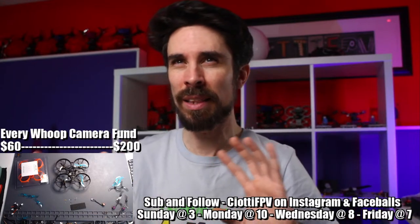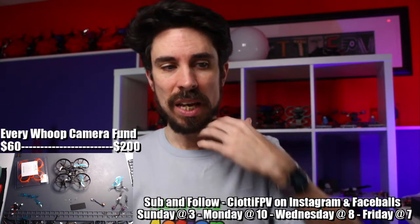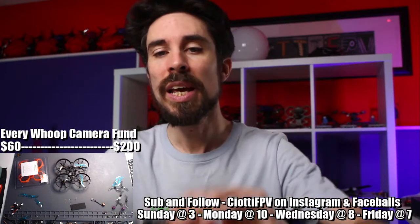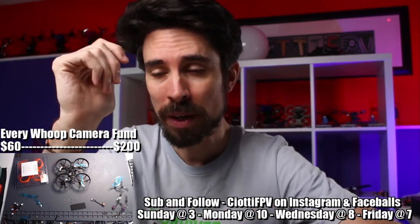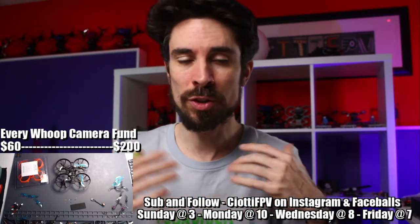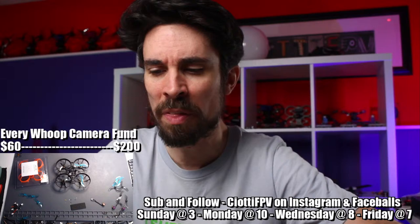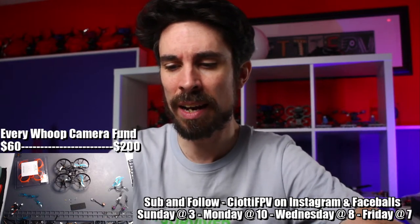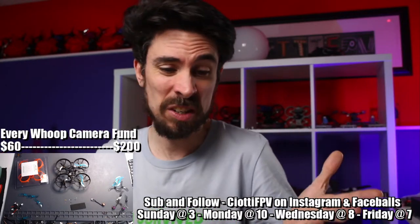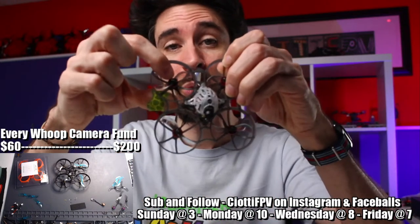On one hand, I kind of like that because it means that we're working the motors. If we choose a motor, the perfect motor choice for a given quad is a motor that just barely heats up, because that means that we've chosen a motor that's as small as possible. So a motor that just barely heats up but never overheats. And it's always kind of freaked me out that Tiny Whoop motors have never been hot. I've always kind of written it off as maybe they just don't make enough power, or they have more airflow for some weird reason, or maybe it has to do with the hub design, right?